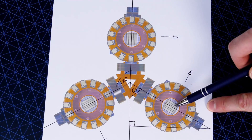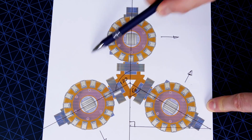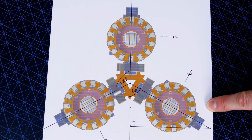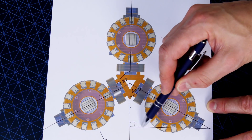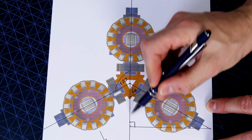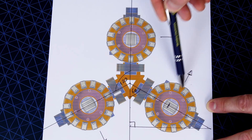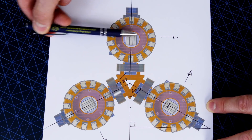Driving forwards is easy because we can just move two of the wheels in one direction and ignore the other one. Rotating is also easy because we can rotate all of the wheels in the same direction and the robot will twist. However, if we want to drive directly sideways we need to get all of the wheels rotating at the right velocity. That's pretty easy to work out though - we can draw a right angle triangle with one side being where the wheel would be if it was straight and the other being where it actually is, which is rotated 60 degrees. Then we can use trigonometry to work out the ratio - in this case it's just cosine of 60 degrees which is 0.5. That means the wheels at an angle need to go half the speed of the one that's straight, because the angle of these wheels causes the robot to twist in its vertical yaw axis so we need to run the straight wheel faster to untwist it.